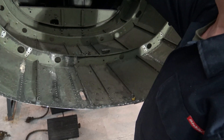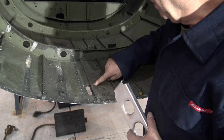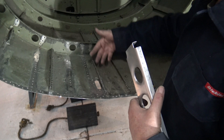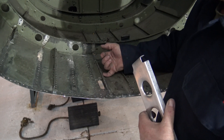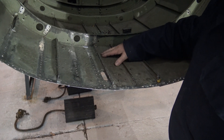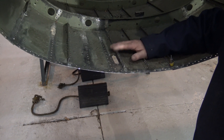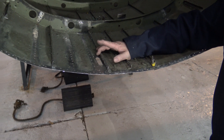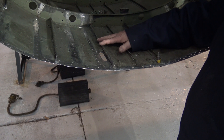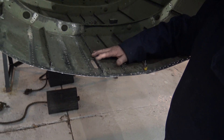Some of them go quite a long way down but there is a special joggle join, so they're not very long — it's just that we don't know what's underneath here. There could be some really bad corrosion underneath there. And this stuff tends to exfoliate because it's been rolled into shape — the way it's formed, it'll split apart, like layers of bread. So we'll take the skin off and have a look at it. If it's okay, they'll just clean it up, retreat it and use it again. But we have no choice but to check it. A lot of it just has to be seen to be checked — we have photographs and written documentation to state that that particular part has been checked and is still up to standard.